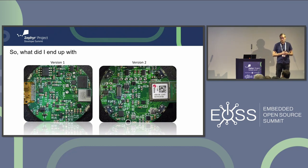I ended up with two versions of the smartwatch. Version 1 worked really well with just some small patches, and was the foundation for most of the software development. It featured the nRF52833, which I eventually grew out of because both RAM and flash were completely filled - as soon as you do UIs it eats up flash and there's not a lot of RAM. So version 2 features the nRF5340 with much more RAM and flash, and I reworked a lot of parts to make it easier to build and solder.